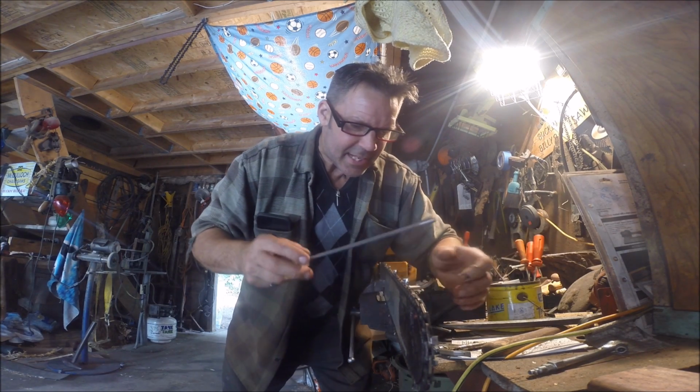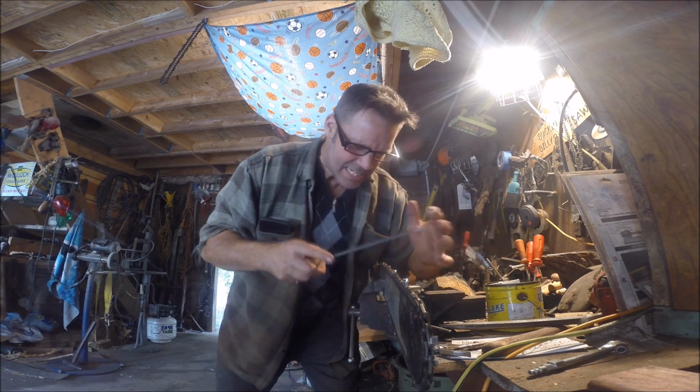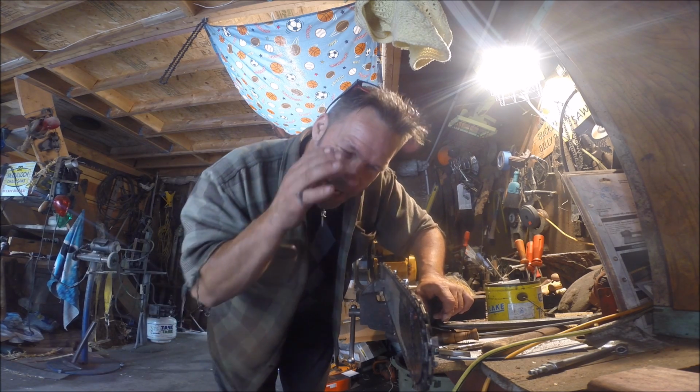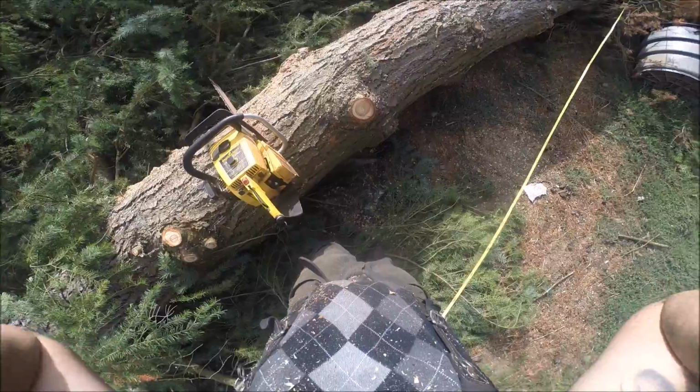Oh darn it, 10, 6 on that one, 7 on, oh no, I've stopped counting about 25 years ago. Don't count your teeth when you're filing, friends. Just sharpen it till it's sharp. Don't worry about that. Your mind should be concerned about getting the tooth sharp, not counting how many strokes. Don't worry about that stuff, it's foolish. Another 16/6 here.